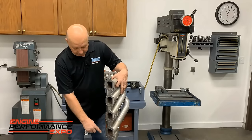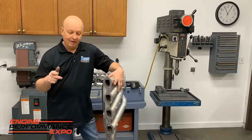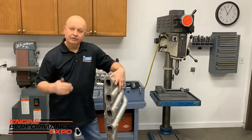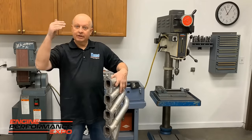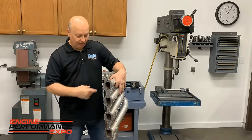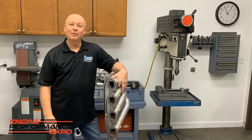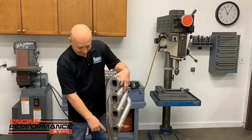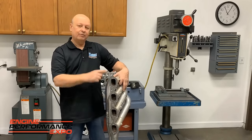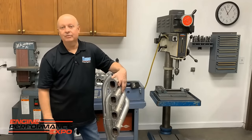We started an oil can down and started squirting oil in the header. After about 5 seconds, that oil was coming up the port, going up to the carburetors. You could see it in the mist in there, every time it pulsed. So that oil started out the bottom of the header, went all the way through the engine, and went up into the manifold, same as the rust would.